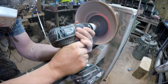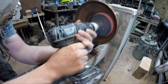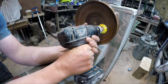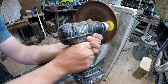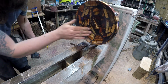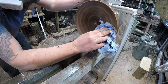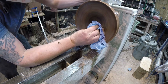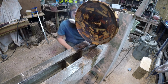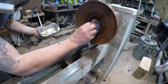Okay, so we've got down to final depth, and I blasted it with the 40 grit pad just to take out the lumps and bumps that the carbide had left, and then I wet sanded all the way up to 1000 grit again. Then a liberal coating on slow speed with the sanding paste. Speeded it back up to 1400 here. And then on goes the shine juice.